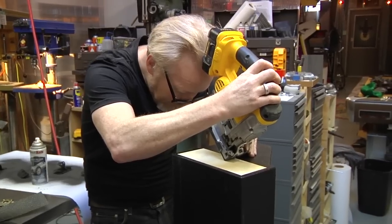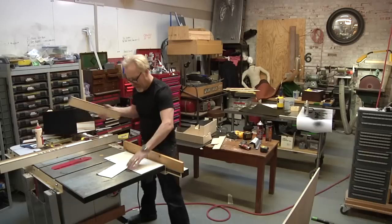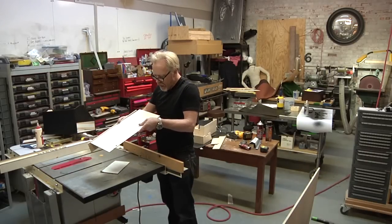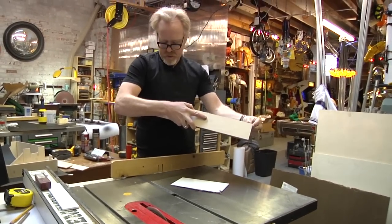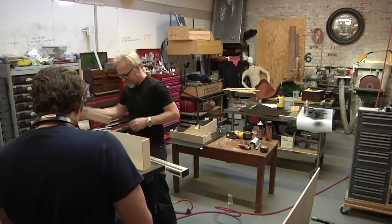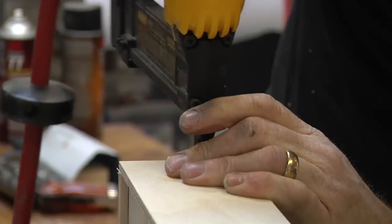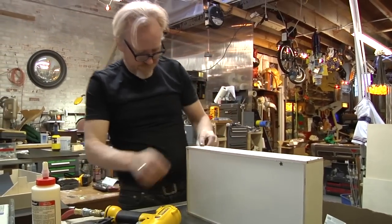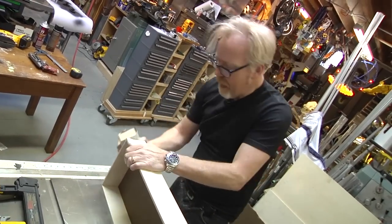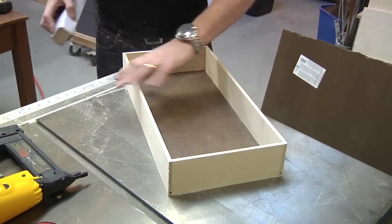Now I'm just doing some of the fine finish edging. This is cutting out the drawer — a tricky part, because I'd gotten a little ahead of myself. That piece I cut out is going to end up being the front piece of the drawer. I had to use the jigsaw and use the kerf of its blade to actually give the drawer the right spacing. I had to peel off paper that I had previously glued on. Now I'm making the drawer in a standard drawer technique: I cut a little groove in the sides of the drawer so the bottom piece floats — standard drawer construction that anyone who's built furniture would recognize.